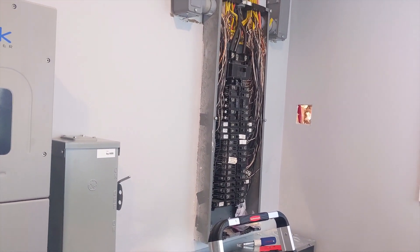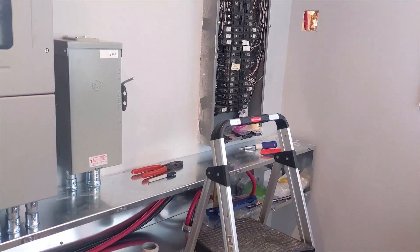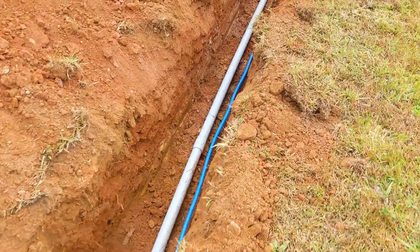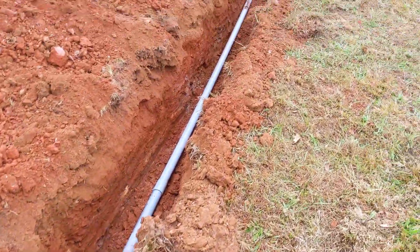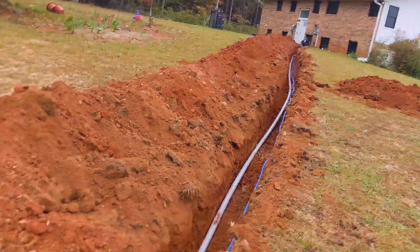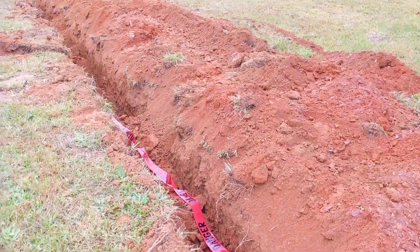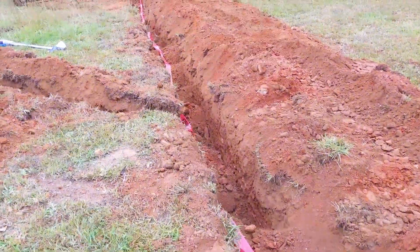We should be in pretty good shape. There are some other things we always end up having to do, but we're making good progress. For inspection, our trench is two feet deep. The customer wanted a water line thrown in there so I did that — it's 2-inch PVC conduit, at least 18 inches to the top all the way. I'm putting trench tape in as the rain is coming; just want to see if I could beat the mud.